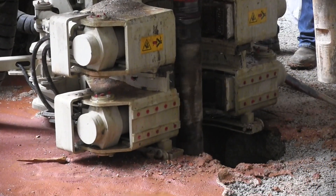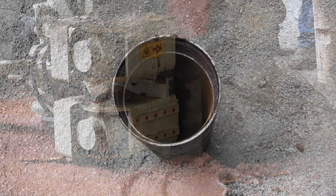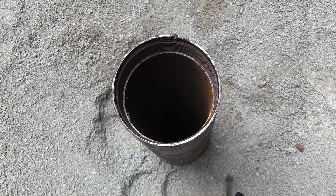What these guys are doing is, once we drill the micropile itself — drill a hole, pull all the drilling steel out of the hole — we slip-line this with the micropile, which is a thin-diameter steel tube, a 7-inch tube. Once that tube's in the ground, we come back and drop a large rebar to the bottom of the hole, past the bottom of the steel casing, the micropile casing, so there's a gap between the bottom of the casing and the steel rebar.